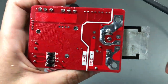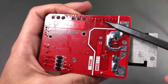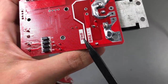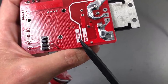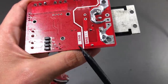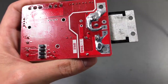Let's check the clearance on the back. It seems like we have good clearance here. It's only if they would have moved this track for the LED out of the way it would have been even better. But on this side we only have about 3mm of clearance, which I don't think is ideal. If I were to design this I would have done it with at least 5mm of clearance here. I don't see the point of extending this ground plane so much, so close to the hot side.